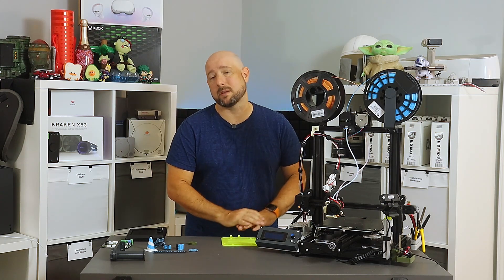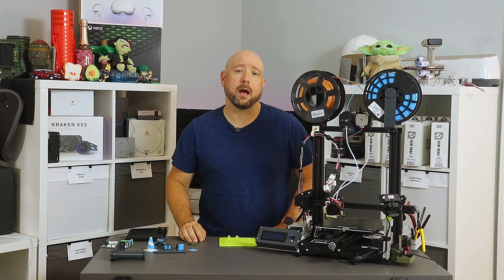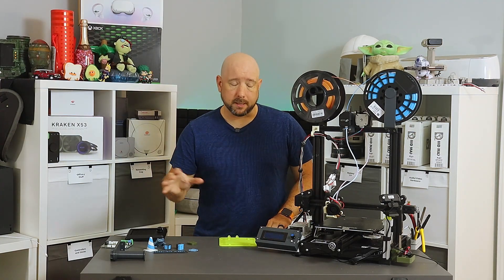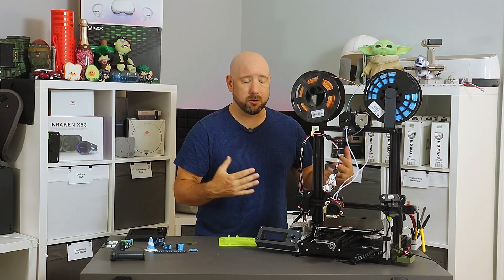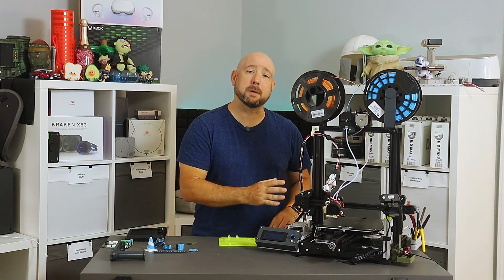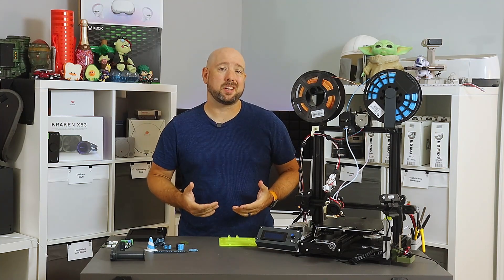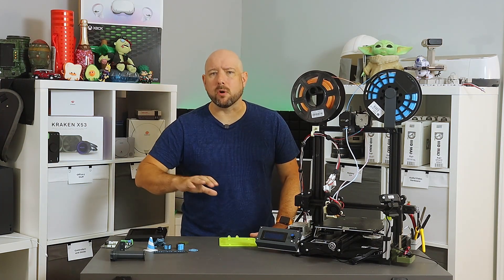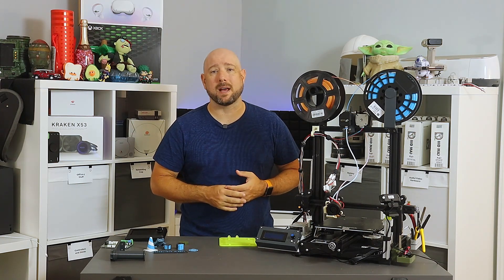You'll definitely want to review that configuration before you try to use it, even if you are replacing with the same SKR 1.4 board. Cura doesn't seem to let you modify manufacturer profiles, so I created a new printer profile from scratch, copied over everything from the Ender 3 V2, and only added a second extruder. I'm using an X offset of 18mm between the two nozzles. The OG Chimera and Cyclops use this 18mm distance, while the newer Plus versions use 20mm, so give this a quick measure before your first print. Besides setting up your printer config for two extruders, you might want to be a little more aggressive in your retraction settings, since there's more time for each nozzle to ooze while not printing, and maybe look into an ooze shield.